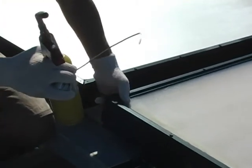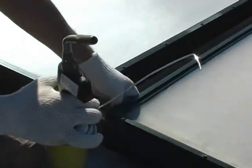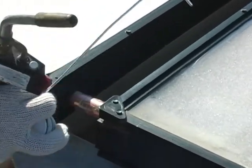The second thing we're going to do is wipe off those globules of flux that aren't in the joint, because the solder is going to follow the flux. We don't want to run flux up this rubber part. We just need a tiny bead of flux right there to draw the solder.